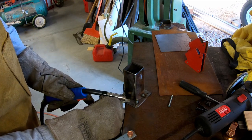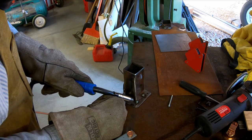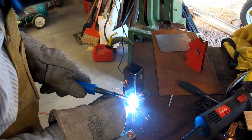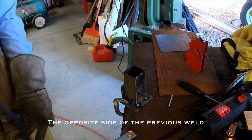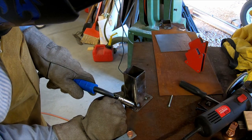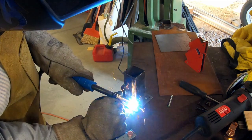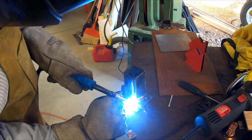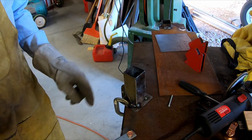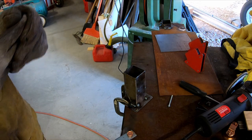All right. Now I'll try to put a small bead in right here, trying to keep more of the heat up on the square tubing. Try filling right there. Not bad — a little more wire or material than necessary, but I can grind that away. I'm just going to work my way around it and show you the finished product.